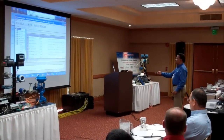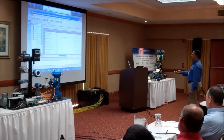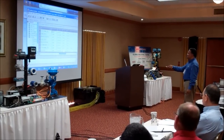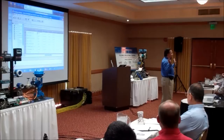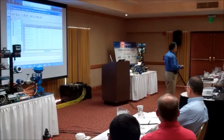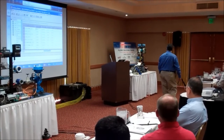When I did the offline engineering, I thought I had device revision 2, and that's how I configured the AO block from that device. Now what I want to do is physically connect this device to my segment. You can see that I have a Fisher Foundation Fieldbus valve positioner here, and I am going to connect this device physically to my junction box.